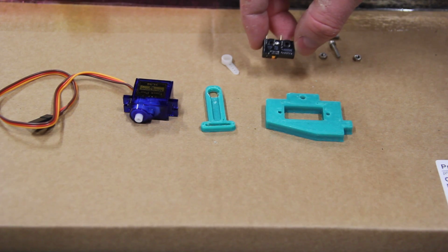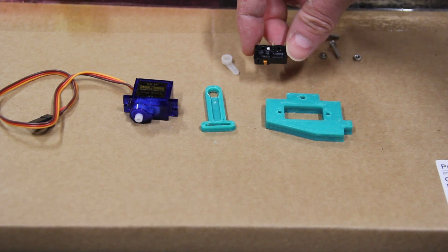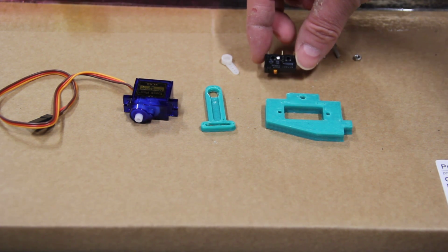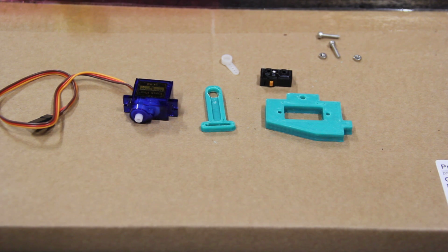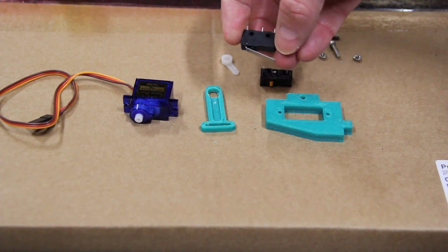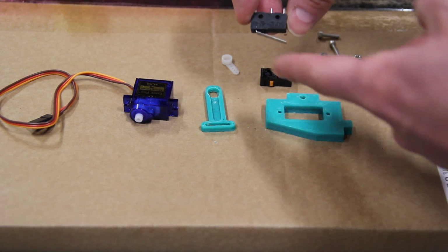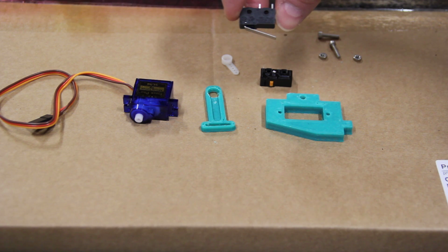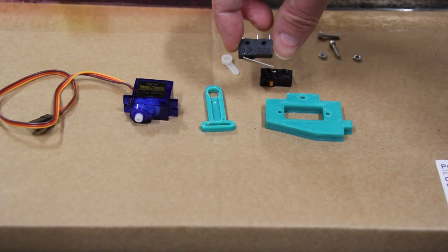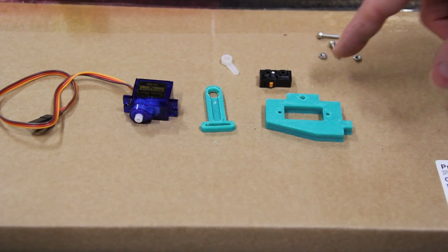We're also going to be using just a standard end stop microswitch. When I first set this up, I actually just used the end stop that came with my printer. But I ended up changing that out just because this one has this lever on it right here. This is one that typically comes with the Makerfarm kit, and that lever for this application actually kind of reduces some of the resolution of this switch, and we're going to need the switch to be pretty high resolution.